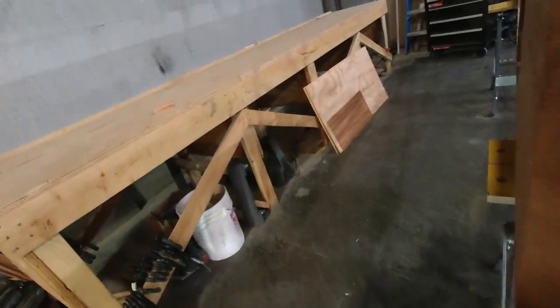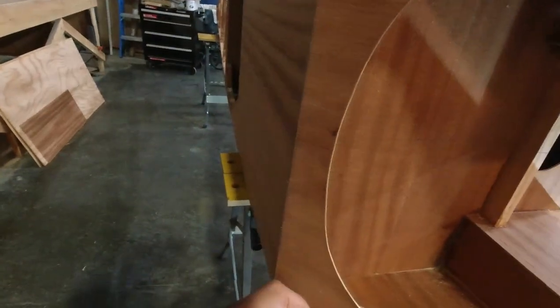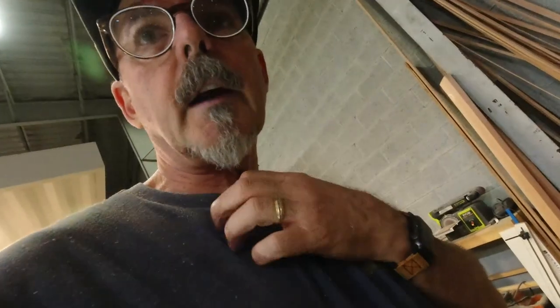This will also give me that really good opportunity to come over and get this piece cut that's going to go in here. I am debating whether I should maybe even just put a small piece up in here. It is helping to hold this front end together, so I may put a piece up under there. Maybe I'll take a piece of maybe half by 5/8 or something like that, and figure out this angle right here. Then I can just cut it and put it up in there just to have a little extra material where that attaches to the firewall. And let me get some marks going, and then we can go from there on this.